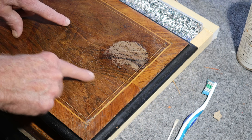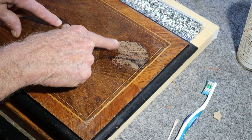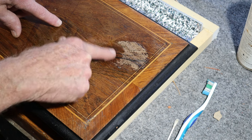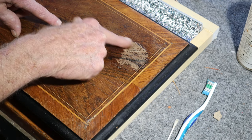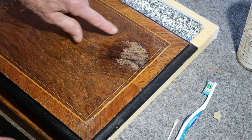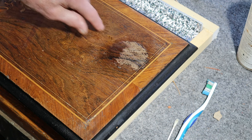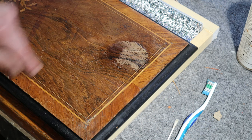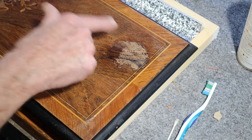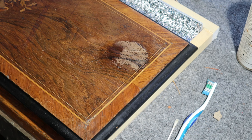I'm not sure about the wood — I think this is walnut and I think this is mahogany. But if we give it the spit test, I think a lot of that darkness is gone, not totally. It's going to need just a little bit of yellowing and a little bit of red toner, I think. But you can only tell while it's wet. I'm using saliva rather than mineral spirits because I don't want to clean the oils back out of it — I've already done that.